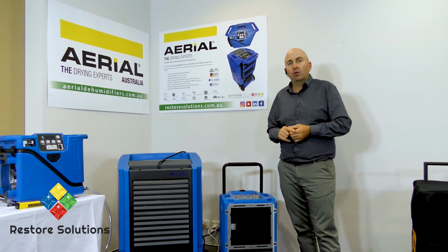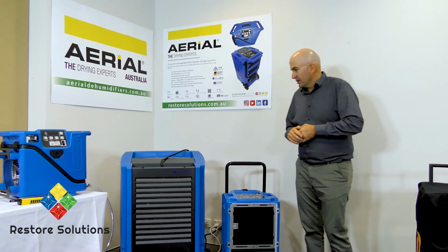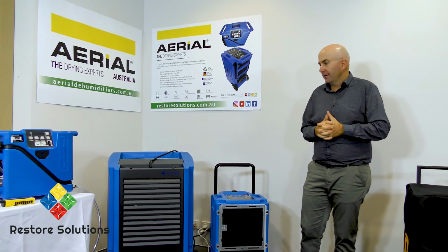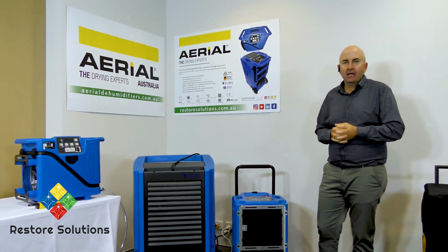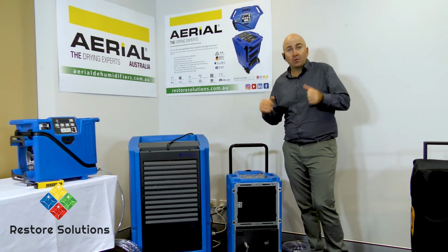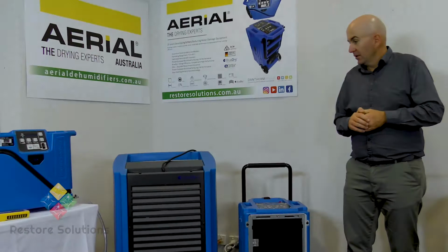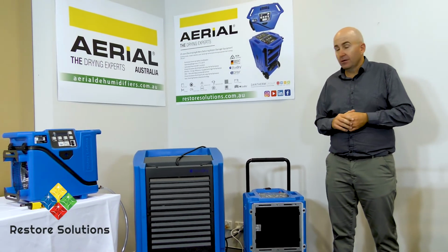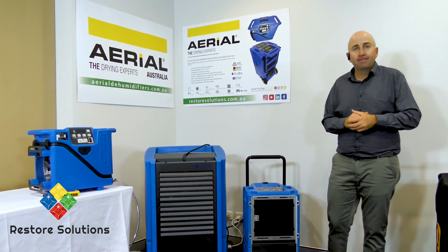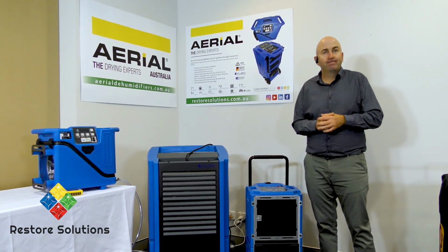So air exchange is very important in your drying job, and people don't really focus on it when they're looking at purchasing a dehumidifier. So longevity as well. Obviously, these units are built to last, and most of the time they get them in for service every 60 to 80,000 hours. We used to have dehumidifiers in Australia lasting 10,000 hours. But these units are built to last. German design, German built. There's more information on our website regarding the product, but I hope those little tips have helped you in your dehumidification process in your drying jobs. Thanks very much.